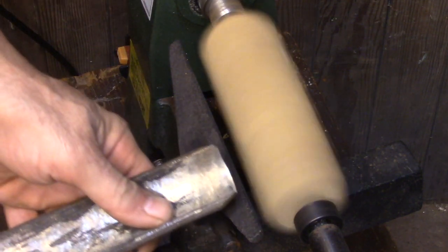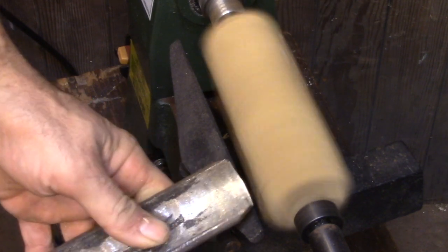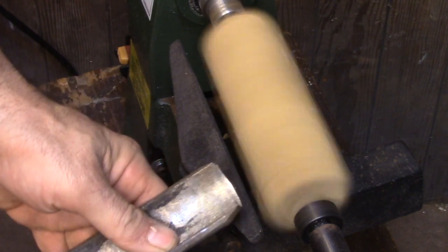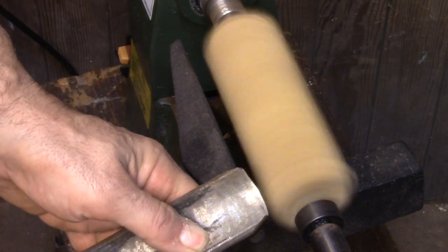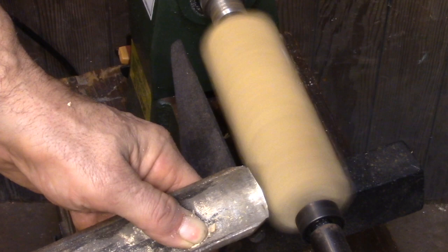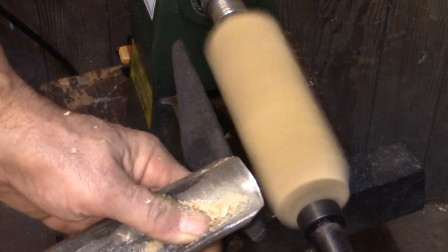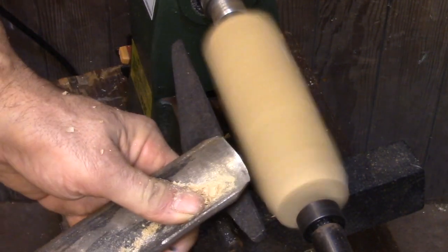When you're starting to rough in a really uneven piece of wood like this you really have to take your time. The rough blank to begin with wasn't sawn square so I had a taper already, plus the drill hole went a little bit off center, so in some areas I'm only hitting one or two corners. Once you start getting something that looks even slightly like an octagonal piece of wood, things really start to speed up.